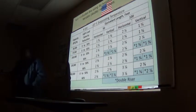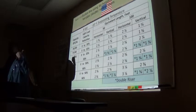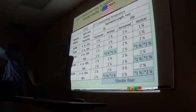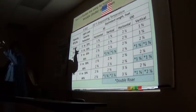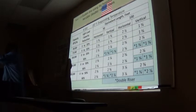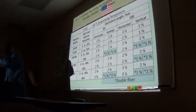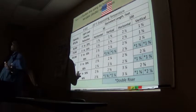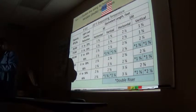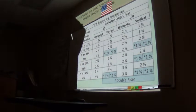Follow that, and most likely if you're buying a complete system from a wholesaler, they'll match it. Like I told you guys yesterday, I give these guys the size of the box I need, all the dimensions with the drawing, and tell them I want this box maintained at a certain temperature. This is my load, temperature range, and how often they'll be opening and closing the door, and whether it's going to be used for hot pull down or holding storage. All of that information I give them and tell them, you size the unit.